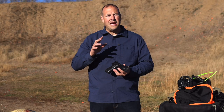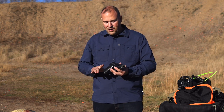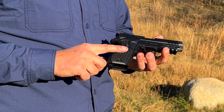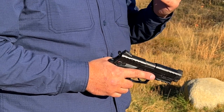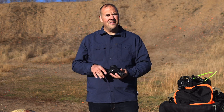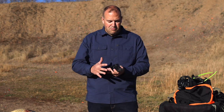As far as size and full specs, we'll post that on our webpage — the description will be below if you want to read about weights and stuff like that. In the hand, the gun is very comfortable and it's pretty close to a Glock 19 size to give you a reference, but it's obviously a lot heavier because it is an all-metal gun. We do have a 7075-T6 aluminum frame with a 4140 slide, and the barrel is 416 stainless, single-point cut, manufactured by a really reputable company in the United States.